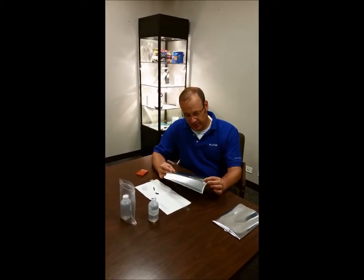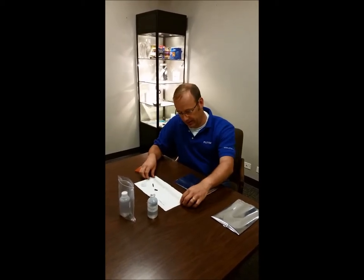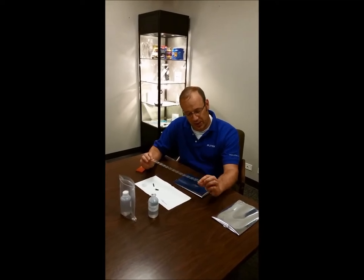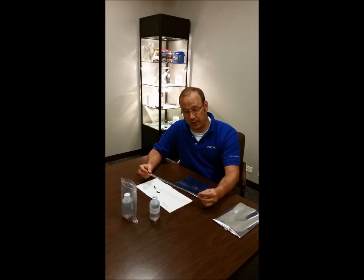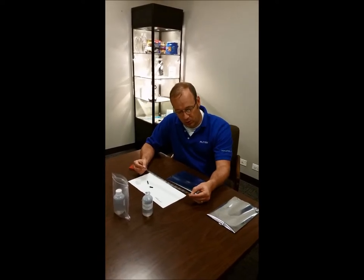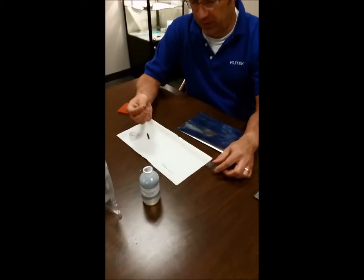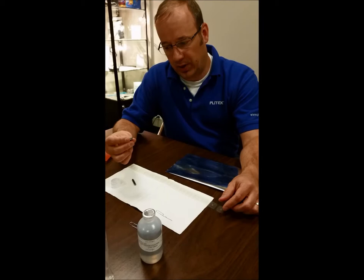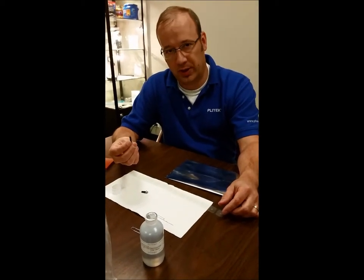The items you need are, obviously, your packaging film or your pre-made bag. You need a strip of valves. There are two sides to the strip — one side has the valve on it, the second side is the liner or the carrier. The carrier actually has a small hole that exposes the valve membrane. You need some form of a punch. We have two types of punches we use here: one is a single hole punch, and the second one is a nine hole punch.